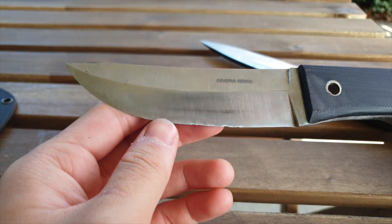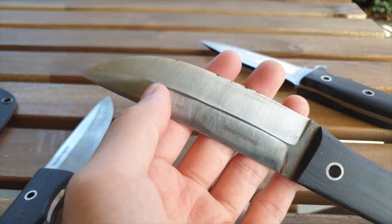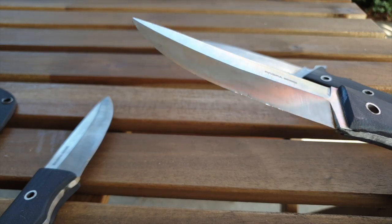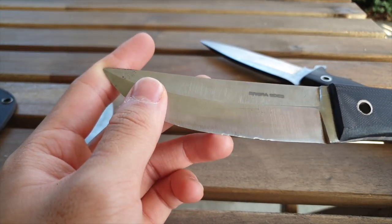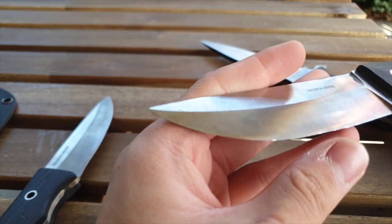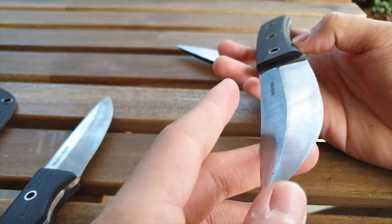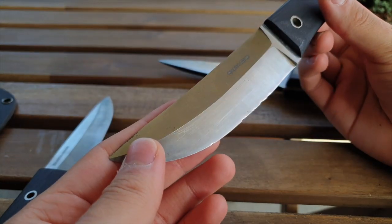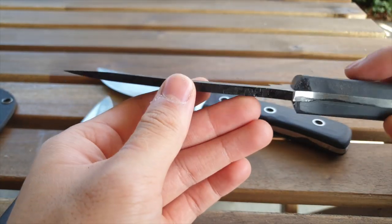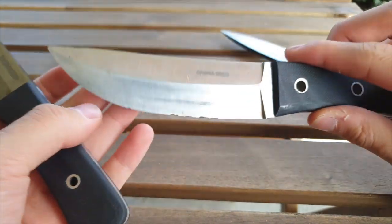I'm gonna have to see what I can do for the edge holding capabilities. So maybe I could use a spring steel or something like that. But as you can see, it just can't handle it when it's ground that thin. If I tempered it a little bit less, it probably would have just chipped, and that's not a good thing. We want it to roll over, not chip. So, blade roll over there. Also, this is a Scandi edge. I didn't put a secondary bevel in this one. I wanted this one to be as sharp as possible. So yes, this one is not good for chopping. But that's probably just that model. This one survived it though, the Ringer. This is a pretty thick beast. RE1 also survived, but Tokyo did not survive.